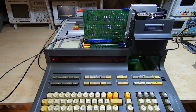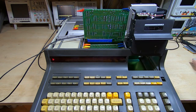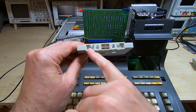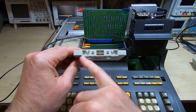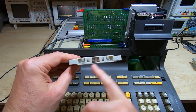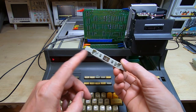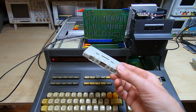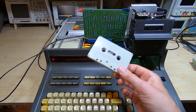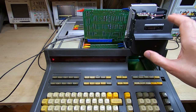I've since acquired a number of suitable tapes. These particular tapes need to have clear leaders because the end-of-tape sensor in this tape drive shines a light onto the tape and looks for the reflection, which comes from bouncing off the inside of the cassette housing. It's fairly sensitive — the tape needs to have a light-colored housing and a clear leader. It can be a balancing act with other types of tape, which is what caused the problem.